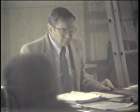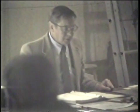Now, this doesn't occur on all machines, of course, but if you get a complaint that is traced to that, you'll find if you use the standard tape, your problem disappears. The engineers in Tokyo, whatever, know about this problem, and we keep hearing that as soon as they come up with any kind of an answer, they'll let us know. But in the meantime, suggest a different tape. But as far as the recording capability and the detail and the noise level, they are far superior to our other standard models.